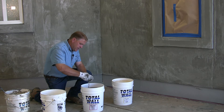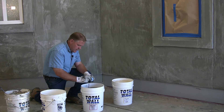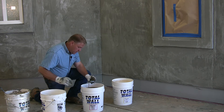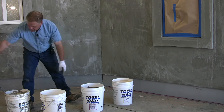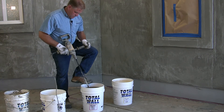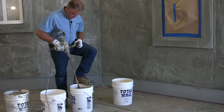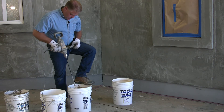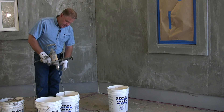The finish actually comes from the factory a little bit stiff, so for this process you're able to add water — up to 8 to 10 ounces of water to the finish. Making sure that we get all the tint into the bucket, blending the material. Make sure that you take plenty of time with the mixture to ensure that all of the tint is mixed in directly into the material.